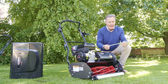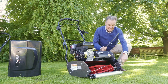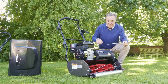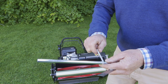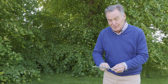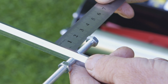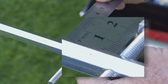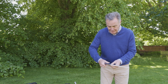The height setting bar is really useful where you want precision mowing. Although there's a good guide for setting the cutting height, if you want an exact amount — say 20, 22, or 23 millimetres — it's very simple to use. We'll set it for around 20 millimetres, wind in the bolt, and use the little steel rule. We're measuring from the top of the bar to the underside of the bolt, so we're 20 millimetres from there to the underside.